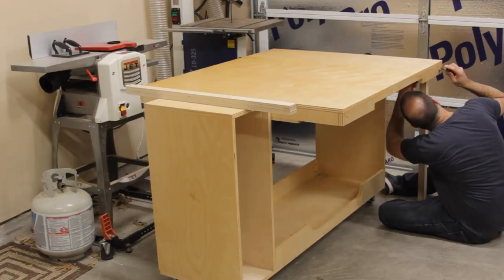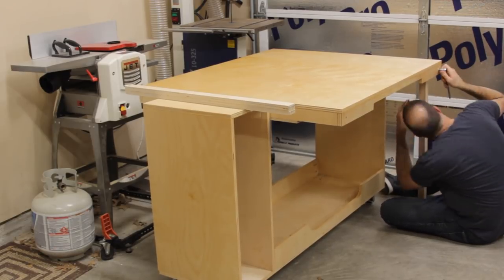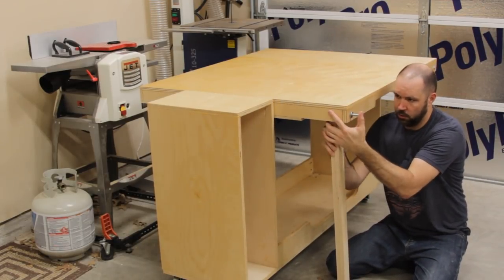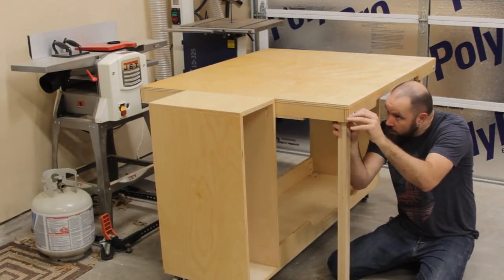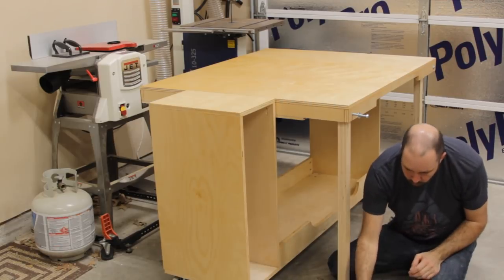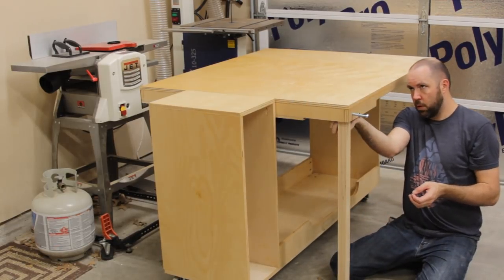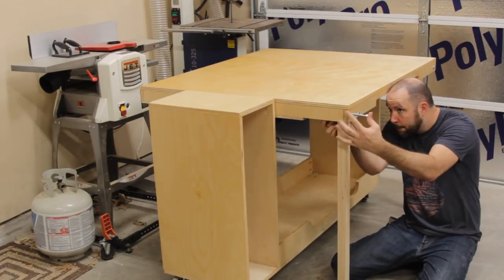I use a 5-inch, 3/8-inch bolt with a washer between the bolt and the tabletop. Behind the leg, I screw on a nut to keep the leg from moving along the bolt, as the bolt extends past the leg to the back support on the torsion box. On the other side of the back support, I use a lock nut to secure the bolt in place.